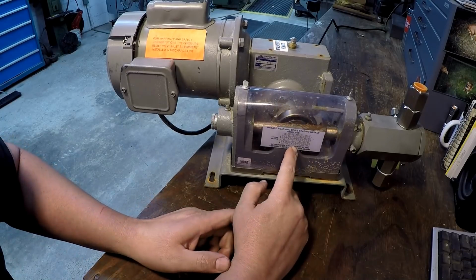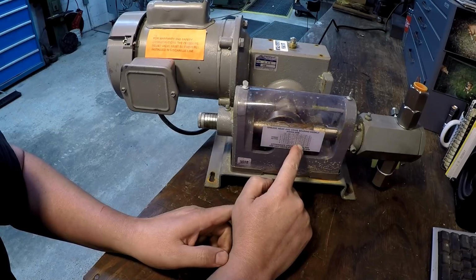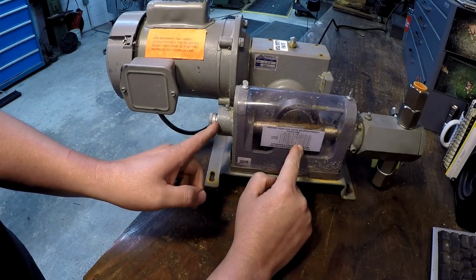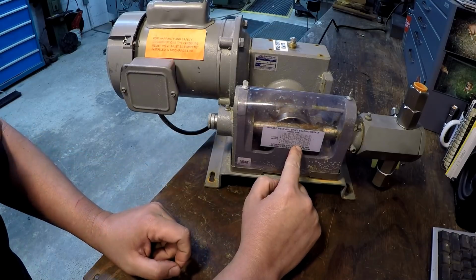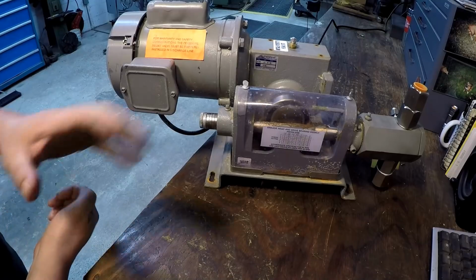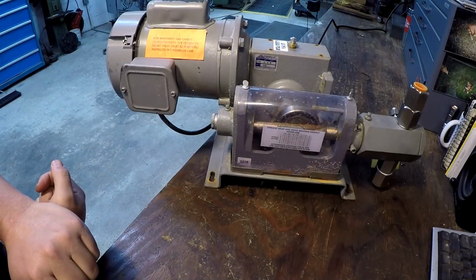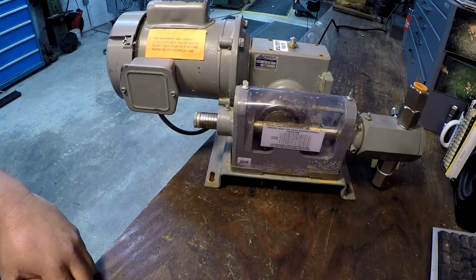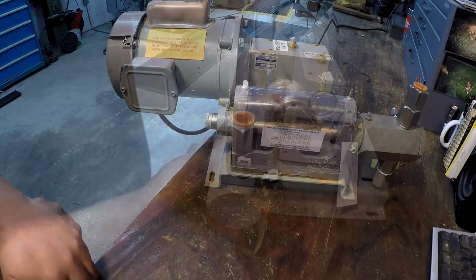But if it's a 1-inch piston and I have it set at 6, which it's set at 6 now, it should move 14 gallons per hour. So I should be able to hook this thing up with my hoses and stick it in the shaper and just let it run for a while, and it should pump it on out of there.